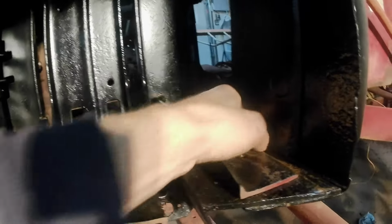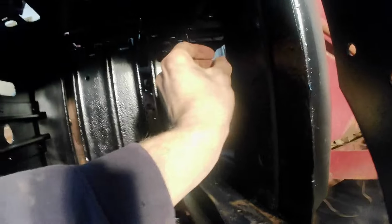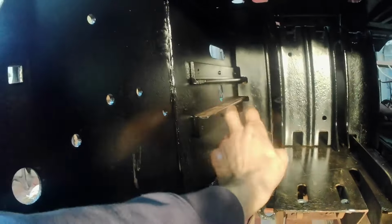So I set the clearance against the bottom of the knives with this guide rail here against a roller, and then as the blades come up, you should have just a little more clearance at the top than the bottom, but just barely. And you set that by tilting the entire plunger in or out at the top by adjusting those rollers up and down. So it rides here on this lower rail, I guess lower and upper, that's where the force is, depending on direction and how it's pushing.